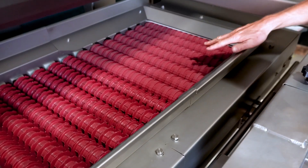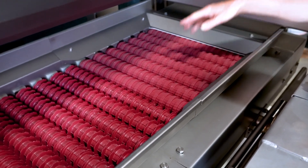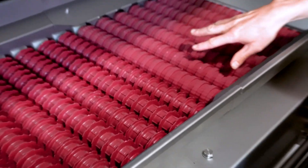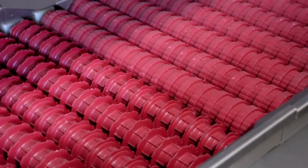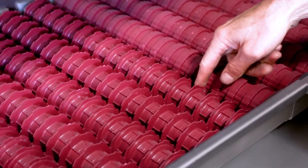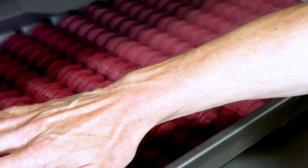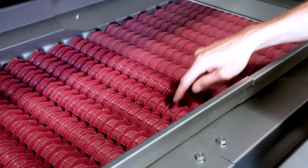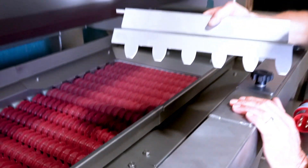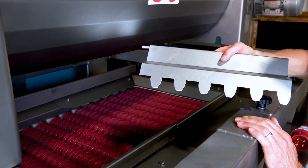This is the automatic sorting table that comes with the Jolly 60 Reverse. You can see really narrow gaps here — this is where any oxidized juice coming through from your bins is going to fall through and get separated out so it's not going into your fermentation tank or receiving hopper. Then there's a larger gap where the individual berries drop through while leaves and stems get shot out into your garbage bin. The gap on the second set of rollers is adjustable via two different plates, so you can adjust it depending on the berry size you're processing.